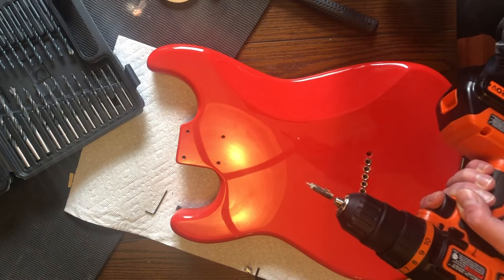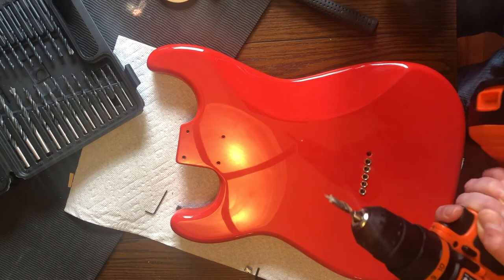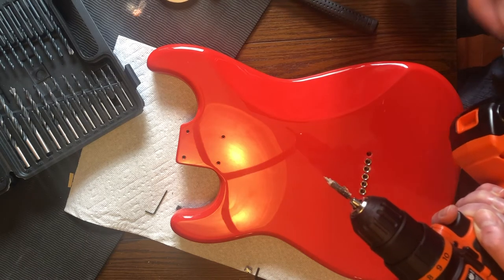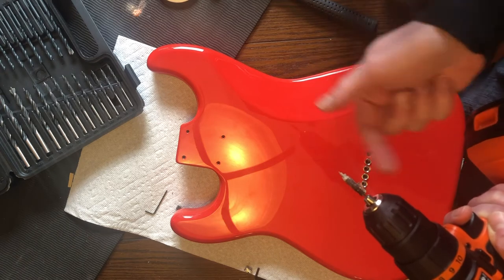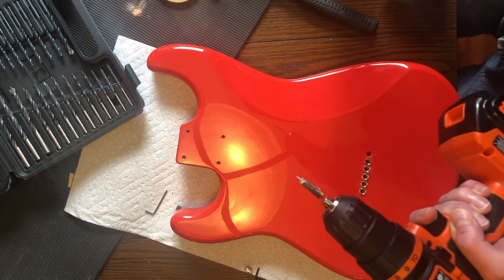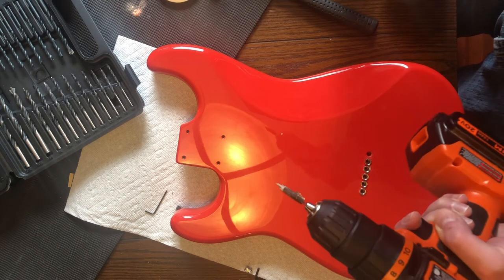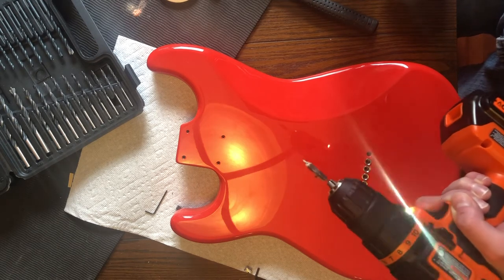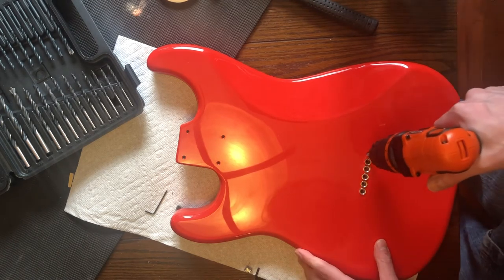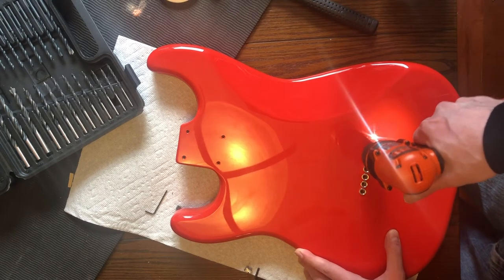Here's my drill that I'm going to use to drill the bridge holes, among other things. I decided I would put a little duct tape around my smallest drill bit and then have some sandpaper stuck to that — so I have a really bootleg drum sander of very small diameter. This actually works fairly well. It's probably not good for the tool, but you just do this.